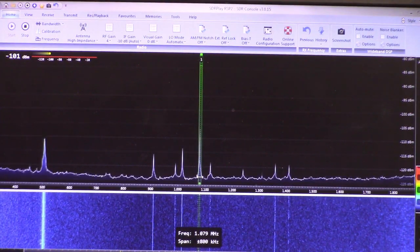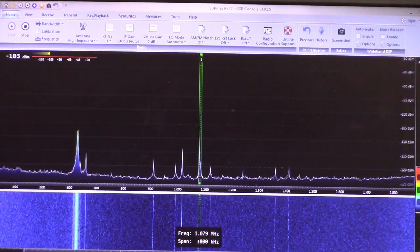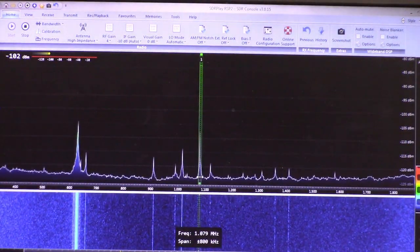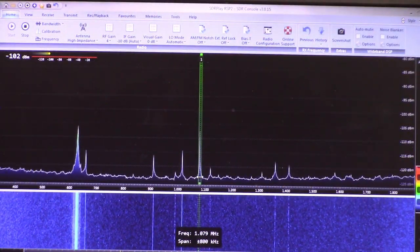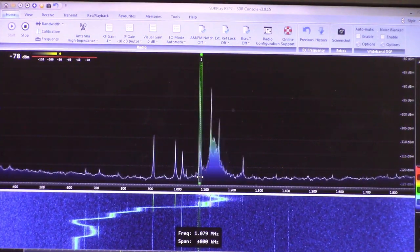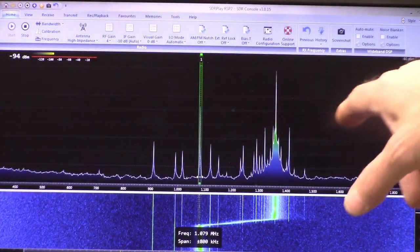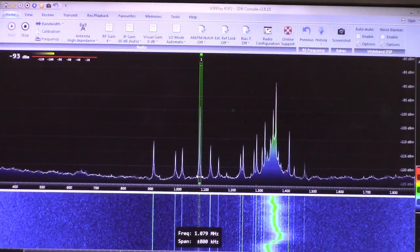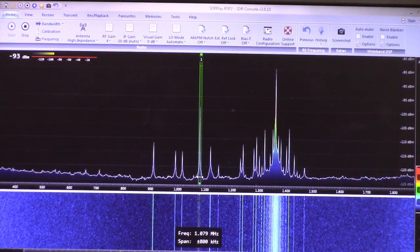I might be able to remove a turn or two to extend it up a little higher in frequency. You may also be able to do this on the 50-ohm input, but the Q of your pre-selector loop combination would not be as high, so instead of selecting single stations you'd probably select three or four. But think about it — if there's a big station dominating your spectrum and causing overload, you can select it right out. Here's another big one — look at how much that is compared to when I get on top of it. It's about 40 dB different. Just thrown together and it works great.